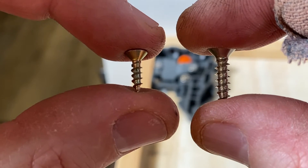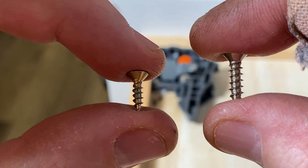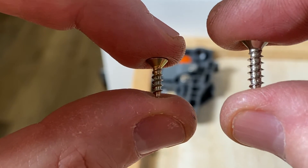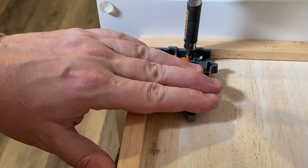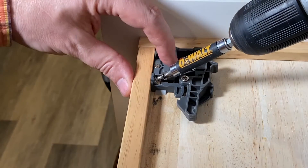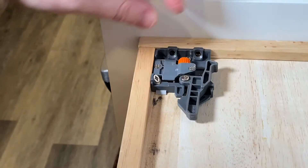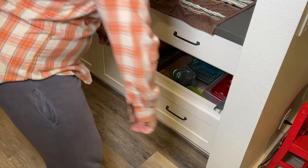I've adjusted to a slightly smaller screw to go into the bottom so I don't go through the bottom of the cabinet. Upon further review of the other one, that's exactly what they did — so I swapped out one screw for the smaller one. We'll take the drill, go right down the bottom one first, make sure it's flush against both sides. Good resistance there, not too much. It's in there looking good — a little countersink equals no split.